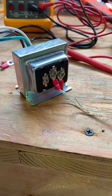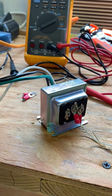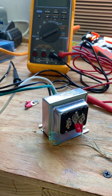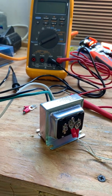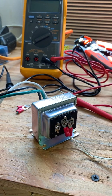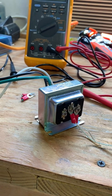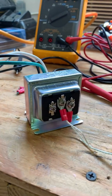This is a doorbell transformer. In your doorbell system wiring, there's a transformer that drops your voltage down from 120 volts down to about anywhere from 9 to 16 volts, or in some cases 24 volts. You've probably seen the new Ring doorbell — some of the older transformers would just drop it down to 9 or 12 volts, still AC but just a lower voltage. This is a doorbell transformer for any old household use, and you'll notice it has three lugs on it.